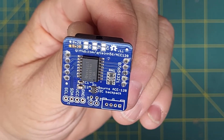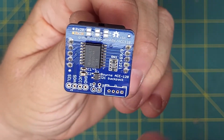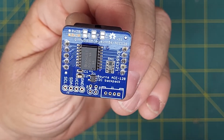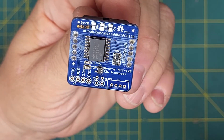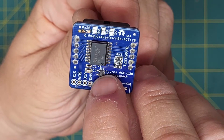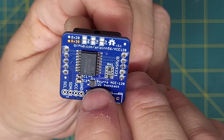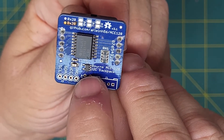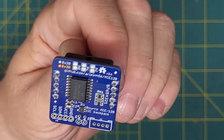For the MKR Arduinos, which do not use the regular Atmel chips, they do not have an EEPROM. The software uses 3 bytes of EEPROM to remember the zero position and how far you've turned it if you're using it in multi-turn mode. There is an optional EEPROM chip on here that the software supports for those Arduinos. You don't need that option if you have a regular Arduino like an Uno — you only need 3 bytes per module, and there's 2,000 bytes of storage available.